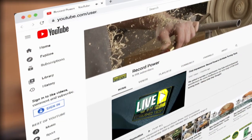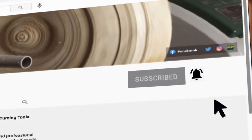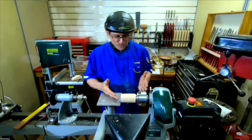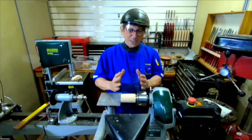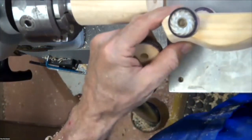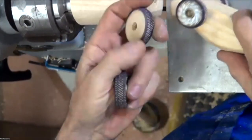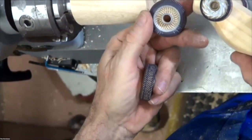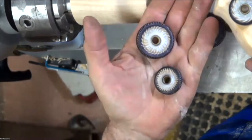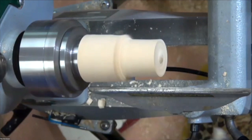I've got a piece of wood mounted here — it's jacaranda. The reason for jacaranda is the grain doesn't come through when you color it, because I want to make some mag wheels. I'll show you those mag wheels again — there's the spirally one and then there's the gold one. I'm about to make them right now using knurling and chatter work.